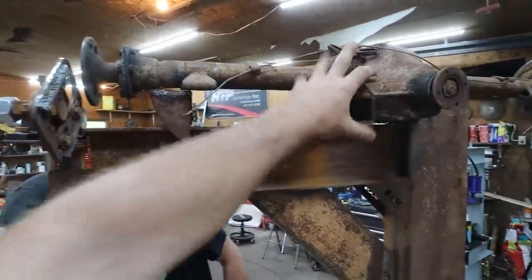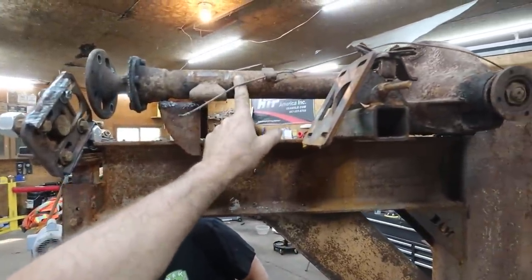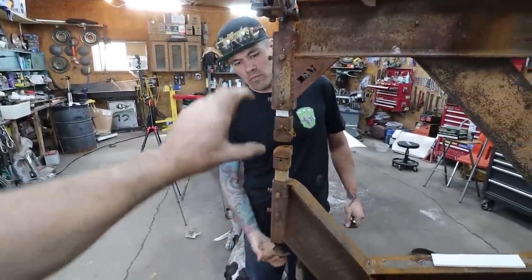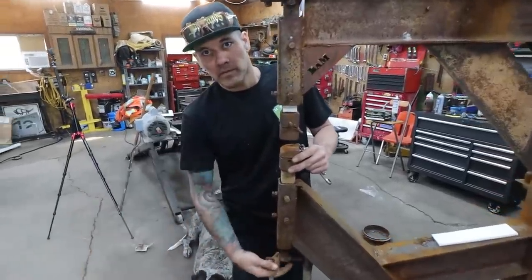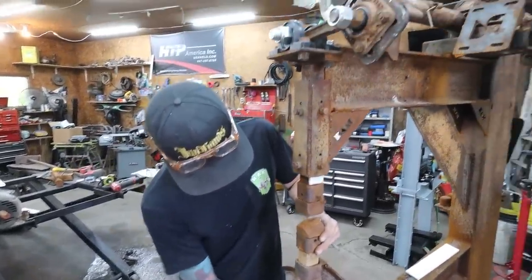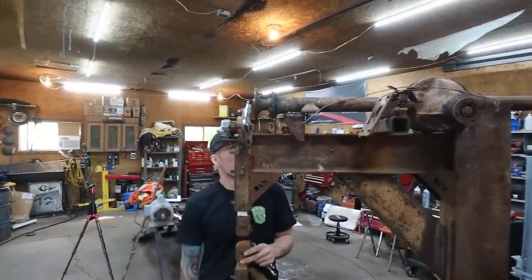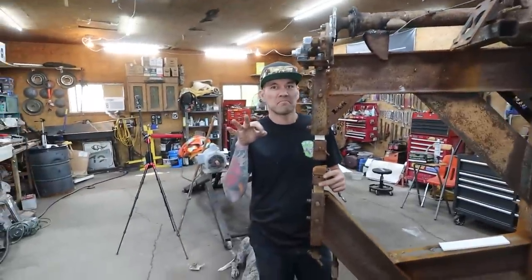Carl's gonna probably cut this off and the motor mount off because I think we're gonna have to switch that all up. And I'm gonna go over and cut on the plasma table a new mount for here and a new mount in the back because our plan is to lift this up about another inch. The way Carl's figuring is if I wanted to do some profile dies or make something, I should just have a lot more meat in between than what I had going on. As much as you can anyway. So that's the plan. I'm just gonna go over, cut these two plates. Carl will probably clean that all up. And then we can at least get the diff kind of mounted. We'll have it mounted and burned. And then we'll be working on the motor. And technically it's almost there.